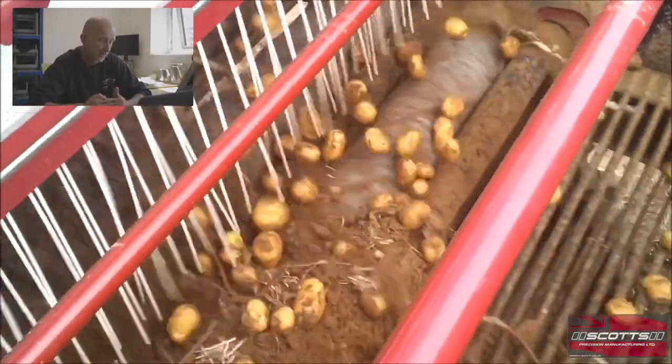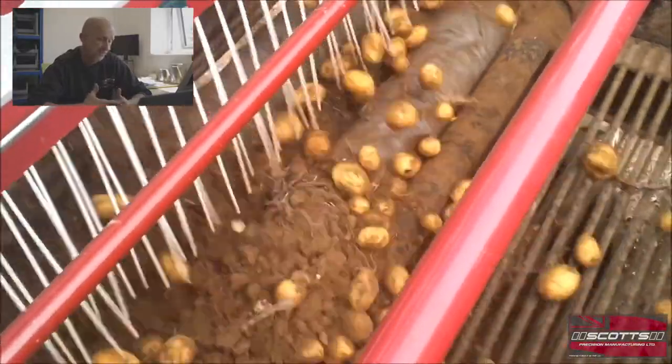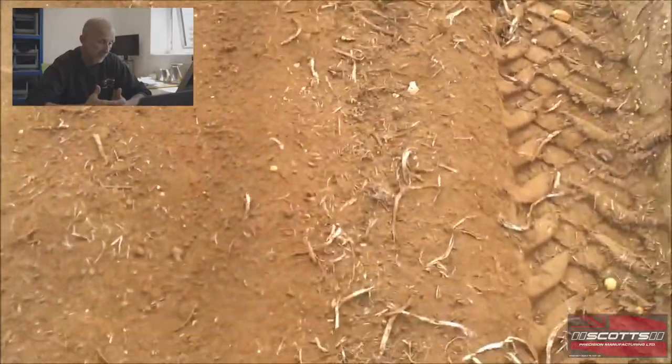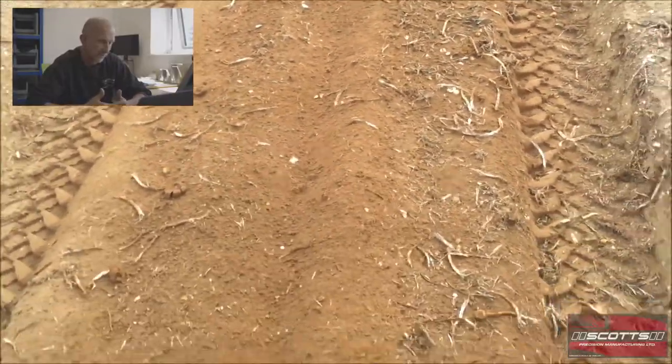As you'll see from the video, we do get really quite reasonable cleaning out of it. The problem in this video is that there's an overwhelming amount of soil traveling up the center of the conveyor belt and overwhelming the separator, but the important thing — especially visible at the end of the video — is that we have no losses of potatoes while still getting the cleaning we're after. The crop wants to be in the valley momentarily, roll around a couple of times, and then move off. We don't want it stagnant — we need speed to keep the crop alive. Hopefully that gives you a better idea of what you're looking for when working on small potatoes.